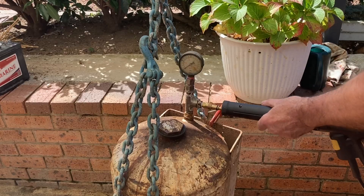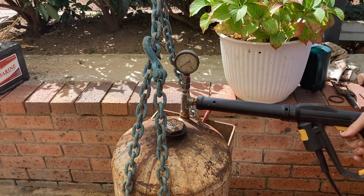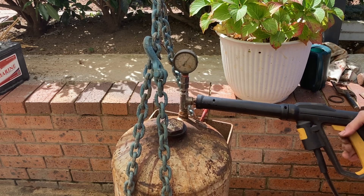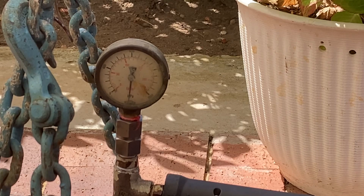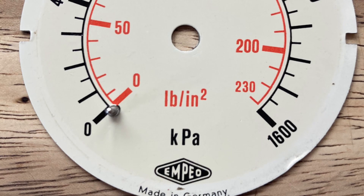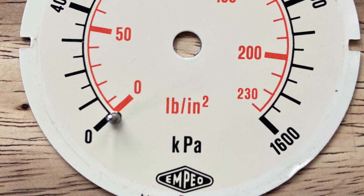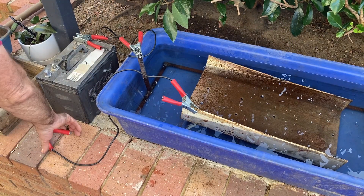Looking okay is one thing, but I really needed to test it, so I rigged up my own hydrostatic test — and you can do the same thing; it's not hard. I simply closed off all the ports, set up a fitting, and adapted my pressure washer to it. The tank was absolutely full of water — no air in there whatsoever. I gave the trigger a couple of squirts and let it rest for a few minutes. I left the gauge and the pressure gun connected and went for lunch. About 45 minutes later it was sitting right where I left it — didn't move at all. The needle was sitting between the K and the P on the gauge, which I figured would be about 300 psi — over double the working pressure of this tank. Not scientific, but I was confident with it.